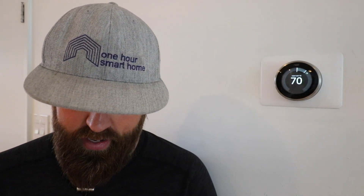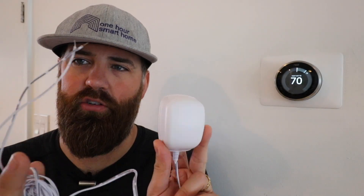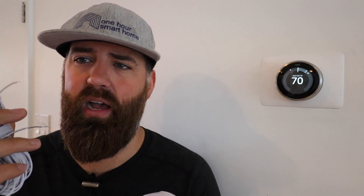The next option for solving your Nest power issues is if you're not getting enough line voltage or not having a high enough battery charge, you can add a common wire transformer. This is a 24-volt transformer — it plugs in and has two wires. We have a whole video that shows you how to install this, and we'll include a link below. The theory is that this transformer will provide power to your Nest if your HVAC system is not providing enough power. It just plugs into a wall outlet and you wire it up into your Nest. You may want to find a way to hide the cord, but this will get you through a Nest low power issue.